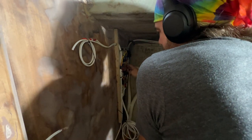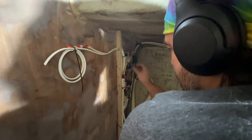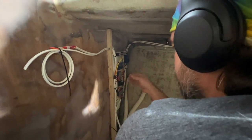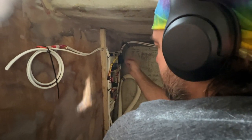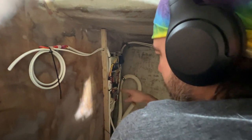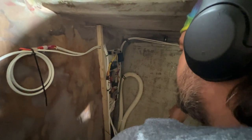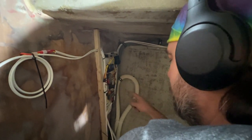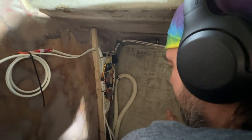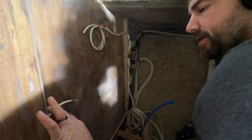Power comes in from here and is split to supply this relay and the terminal block. The relay can handle lots of amperage just like the pump needs. But things like the timer and the button that turns it on can't. So what this relay does is it gets a signal from the button to close the big gates and send power to the pump directly. Everything else is protected by a five-amp fuse which lives in here. The button is pushed, it tells the pump to turn on for a predetermined number of seconds — which we can set with this timer — and then the pump gets powered for that period of time and turns off. There's also lights in here operated by a switch that'll live right here in this wall.